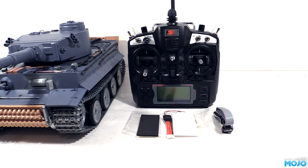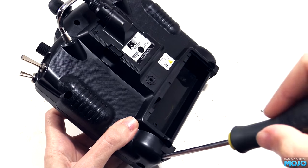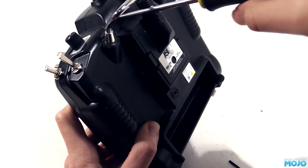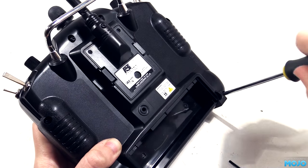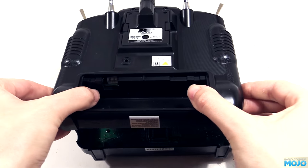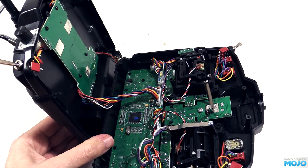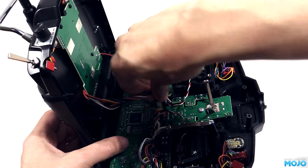I think we're going to start with the backlight. The battery needs to come out along with the 6 screws that hold the case together. The screws are self-tappers and appear to be quite soft metal, so be careful not to slip and strip the heads. Very carefully lift the back off - don't just yank it off as you will probably break something.